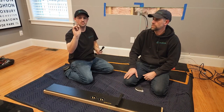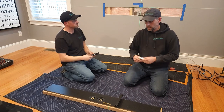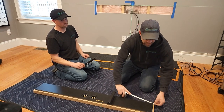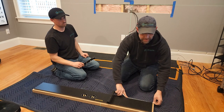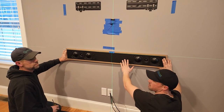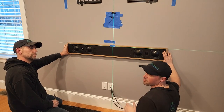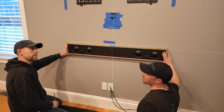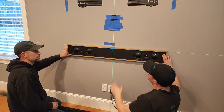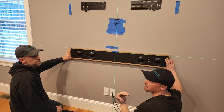They've already put black paint on the front of these screws so that they don't shine through on the grill. Before you place it into the wall or try to screw the speaker in, we have the gasket seal tape. It goes on the back edge here, and that helps to reduce any sound transfer rattling into the wall itself. After removing all the sheetrock screws that may still have been into the stud at the location where we want to put the speaker, we now know that the speaker sits flat into the wall. We still have the vapor barrier there, but we were also able to use all the equipment that was sent with the bar.